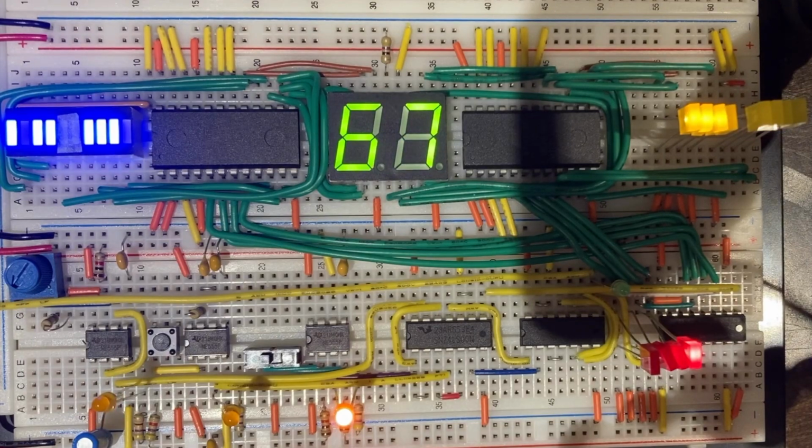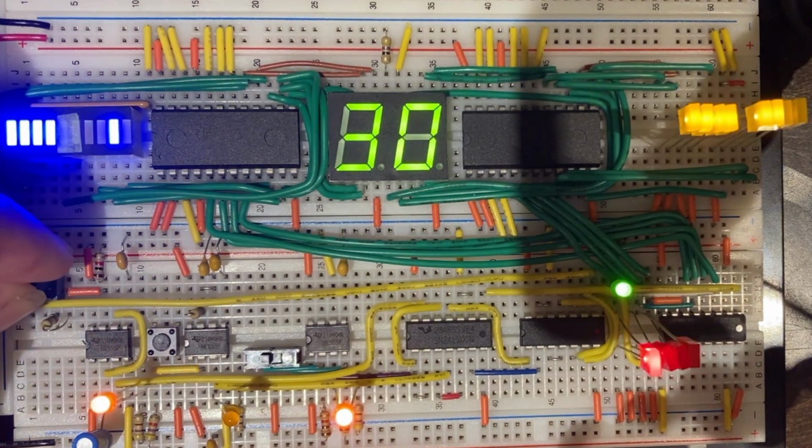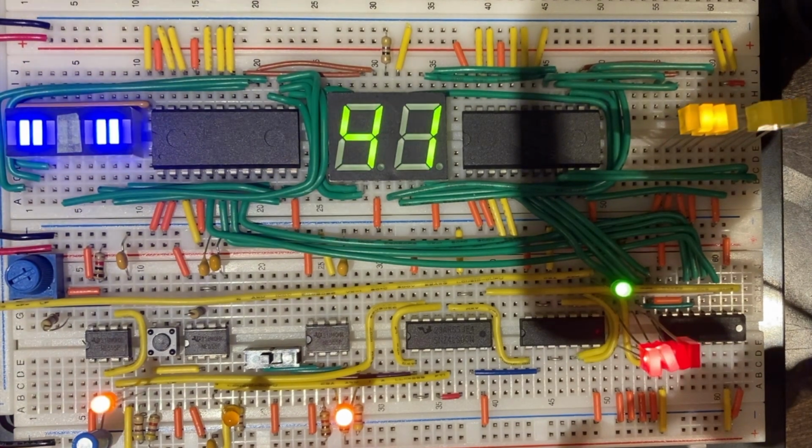Project 3.1.2, Program and Control EEPROM. The second stage of the CHUMP build incorporates code onto the board using the AT28C16 parallel EEPROMs. It's also built off the program counter outputs from the previous stage of this project. A shorter summary video for this project is linked in the description below.